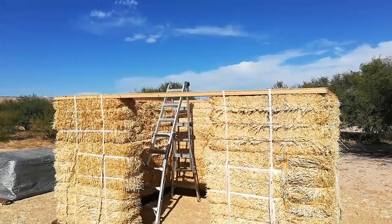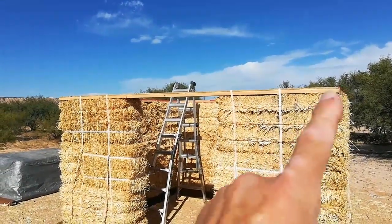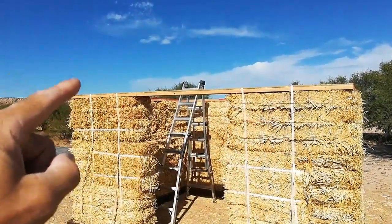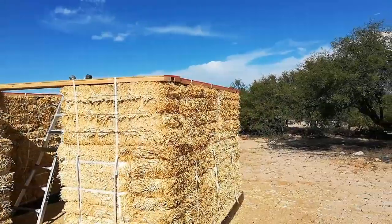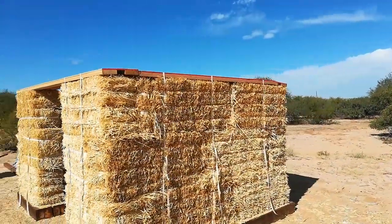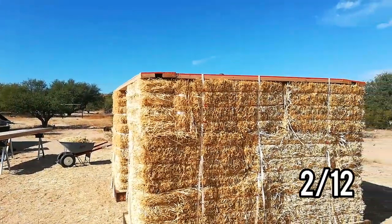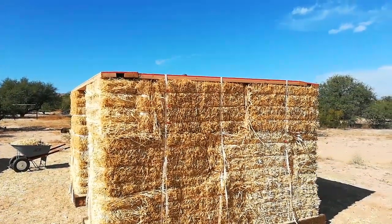So as I mentioned, we're going to begin with a clerestory, and it's going to be the entire width of the front of the building, 18 inches tall, and what that'll do is provide us with a 3/12 pitch going to the back wall of the tool shed.